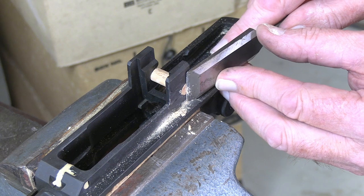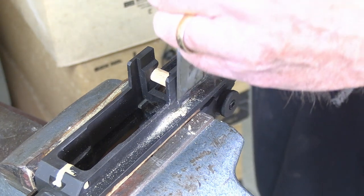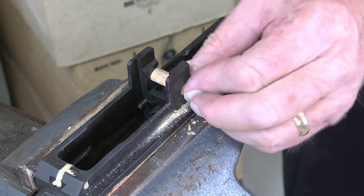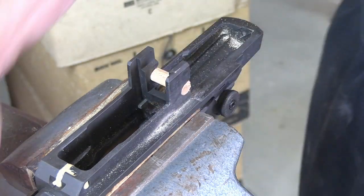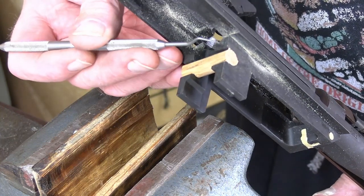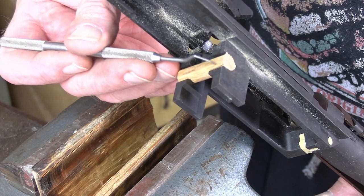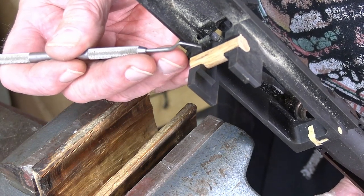It's cutting nicely against that end grain. Just work straight down without destroying my chisel edge. That's sufficient. And check the other side here, that is flush. Okay, so we've got that done. Now if you look right here, these recesses, top and bottom, are the reason for the quick-setting epoxy. We're going to apply some quick-setting epoxy in there. But before we do that, we'll put some wax, some shoe polish, and that will provide for an easy release of that when it's done.